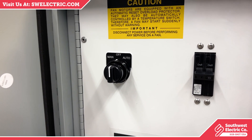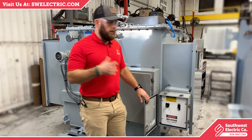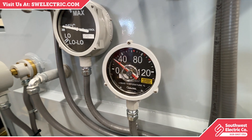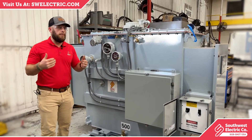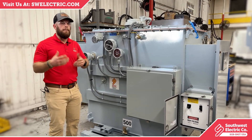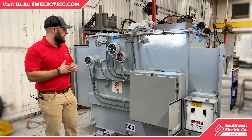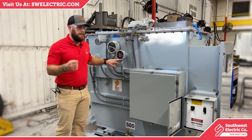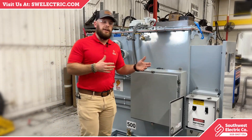As you can see, the first switch gives you three positions: you can turn your fans on manually, completely turn them off, or turn them on auto. If you turn them on auto, it will take into account the temperature of the transformer. The fans provide additional cooling — if for whatever reason you need additional capacity at certain times, fans can provide a boost in capacity for operations. When the transformer starts to reach a load or temperature where it's getting too hot without the fans, the fans will kick on and provide that extra cooling boost so it can continue to run without affecting the life of the transformer.